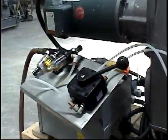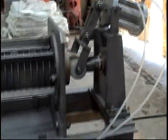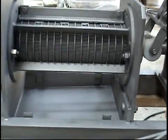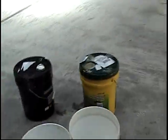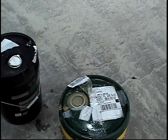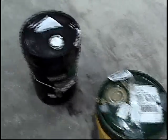I've got an air valve over here and an air regulator. I'm going to catch the press cake down here. Press liquid will come through the screen, out the back and into this bucket here. We have two pails of sample — one's been thickened in a side hill screen and the other's non-thickened. The material looks like this, which looks like spent grain.